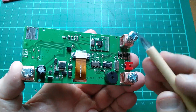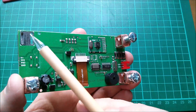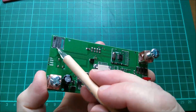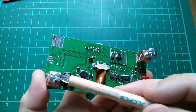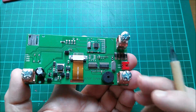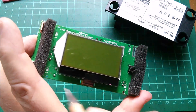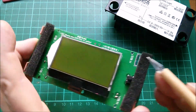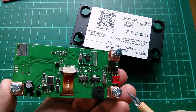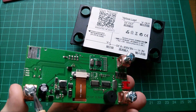I think this is a bit short-changed just having three connectors here. The two positives — are they actually connected together? Yes, you can see some tinned copper across there which links the areas via vias, so yes you can use a common terminal for that, saves money I suppose. On here it says N and L — two L's and an N. Is that live and neutral? That's just daft because this is DC. Anyway, this shows V-in and V-out, hence the shunt across there for current measurement.